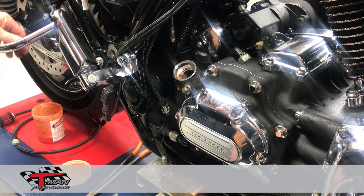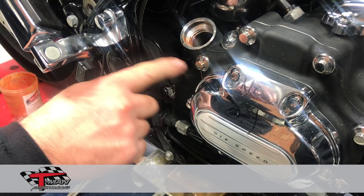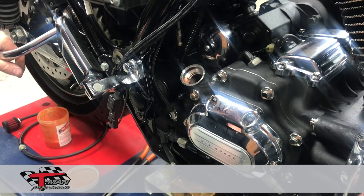Once that is done, it's very simple — you just screw this fitting in here. I like to tap the hole deep enough so it will have a little tension on it, so it just tightens up right when it comes to the bottom of the threads. That way you don't have to run pipe dope on there and have it oozing out everywhere.